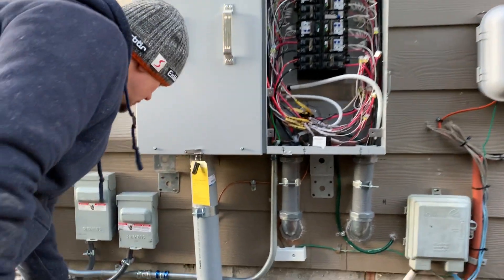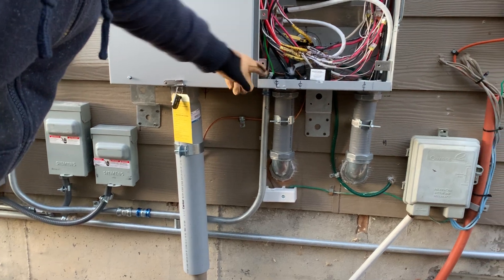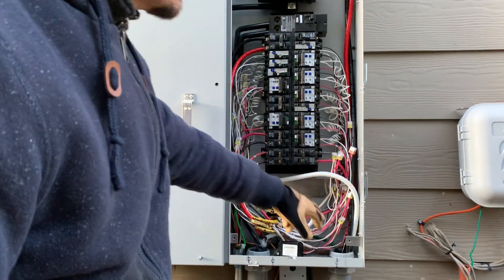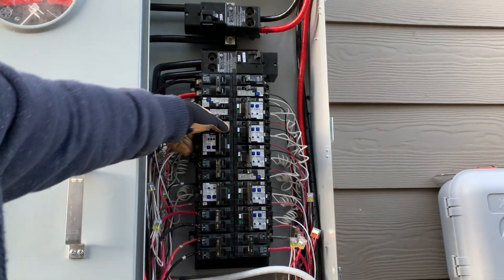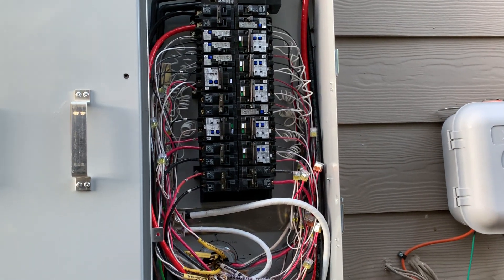Got me re-energized. I got my solar conduit extended and put in, and my sub-feed 100 amp going downstairs, my 200 amp downstairs, and this 200 amp feeding all of this. We did also put in arc fault breakers for all the circuits that we had talked about.